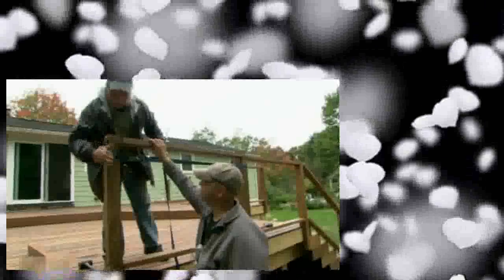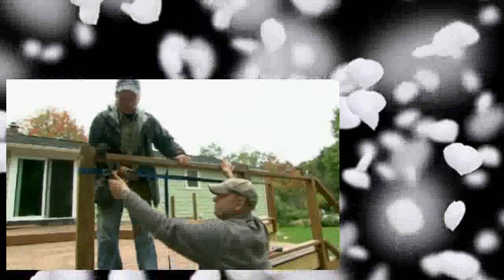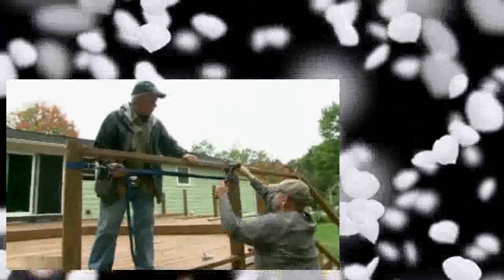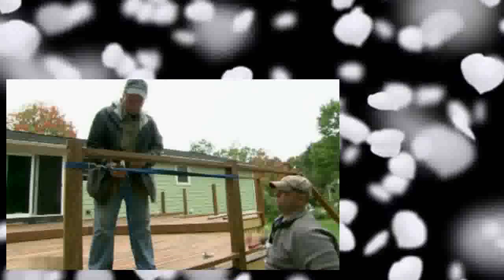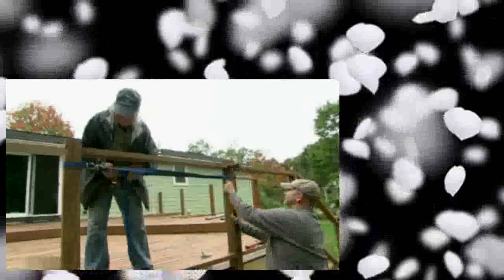Now this post has a little bit of a curve in it, so we need to pull the post back. To do that, I'm going to use the strap right here and ratchet it back into place. Okay. All right, just give that a little tap. Good. A little more. Good. Now go back. Okay. Now the dovetail will hold it together.